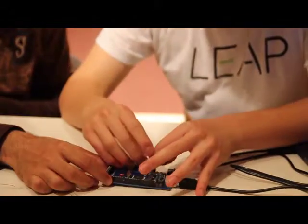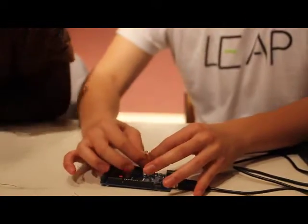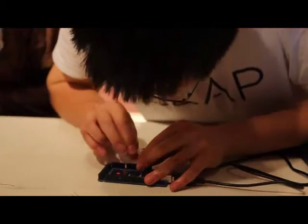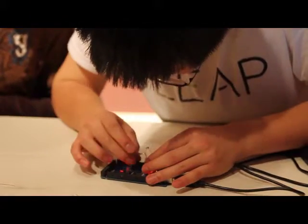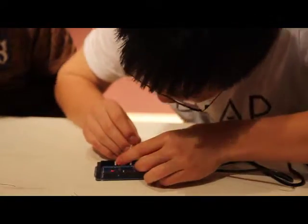So this basically just means that this is where the resistor and the photoresistor connect. And then it's also connected to A0, so then we'll be able to get a voltage reading out of here. And then this needs to go in ground. What's the closest ground that we can plug into? This is probably right behind. I'll have to do a little bit of acrobatics here.